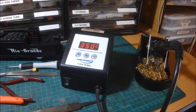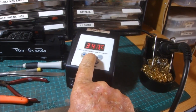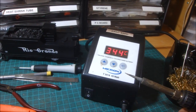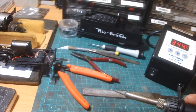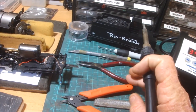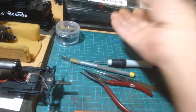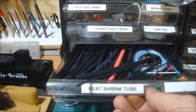The soldering station I use is temperature up-and-down, so we can go up or down. That's very important — somewhere around 340 to 350 degrees is where I do my normal soldering, and there's the size of my tip. That's the one I use for surface-mount leads and all my general wiring. For tools, I'm using just some basic tools — files, cutters for trimming all my decoder wire, pliers, a magnetized screwdriver, and heat shrink tube.